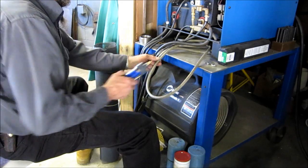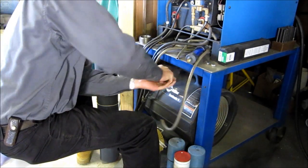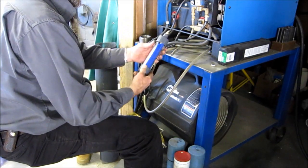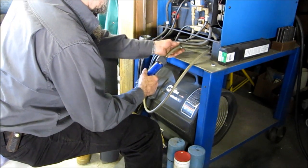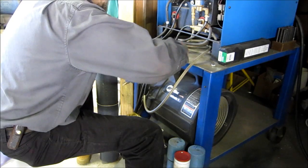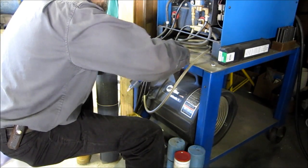I'm going to go ahead and cut my line right there. I can always change this. I'm going to slip a hose clamp up here. It doesn't matter which way — I've got filters going both directions on this thing. The particles in the desiccant are small enough to fall through a regular household screen, so I don't want them to travel through the line up into the torch and get into that area as well.